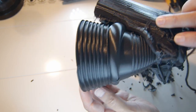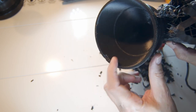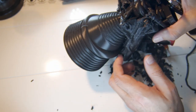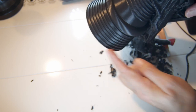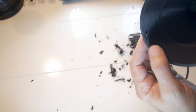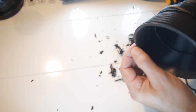Held up pretty well. Now I've got an issue here. See here, the print orientation being like this. That's how it printed. As it's coming around and printing these edges, it was leaving fine points, and they started to curl up. And rather than let the print sort of destruct itself, well, it was starting to catch on the actual part cooler.